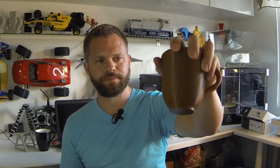To test this out, I printed two coffee cups. This one is straight out of the printer — it's kind of shiny looking, translucent, a little flexible — while this one has been baked for about an hour at 100 degrees Celsius. By the way, once you're finished with the annealing process, leave the part in the oven until it cools down, or you will get problems with warping.